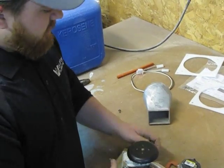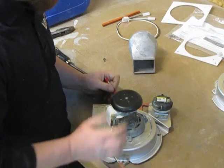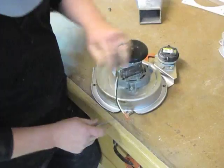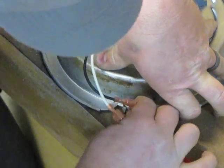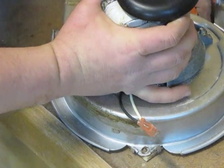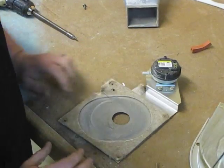After you've got the flue collar removed, there are tabs. You want to bend them back with a flathead screwdriver — try not to break them off. After you have the tabs bent back, disconnect the vacuum line and pull the inducer off with the pressure switch mount.